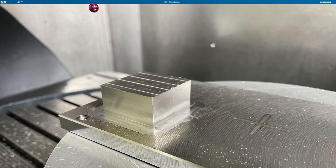We must add the next volume by laser cladding, but there is a problem here. The top surface was flat and slippery, so we cannot hold metal powder on the top surface — the metal powder will flow down off the surface. So we cannot add laser cladding in the Z direction, and we need some trick here.